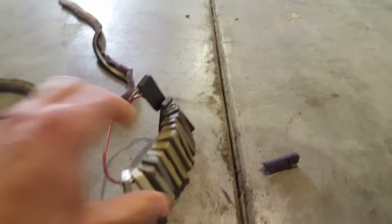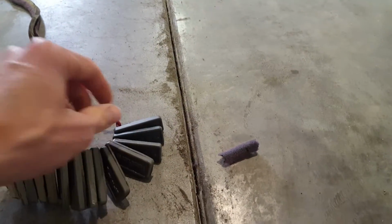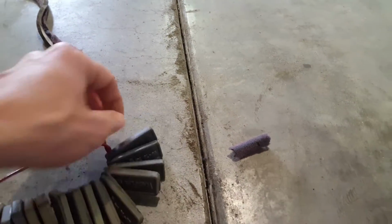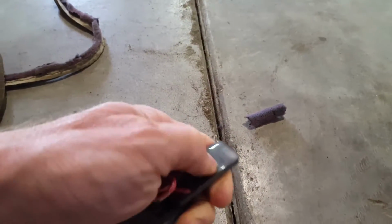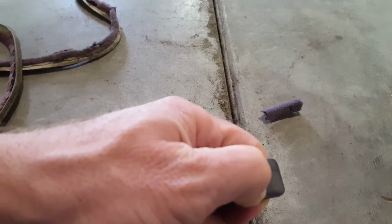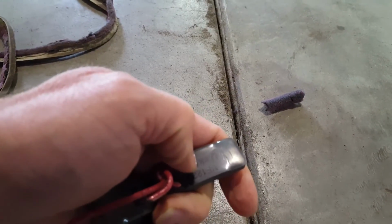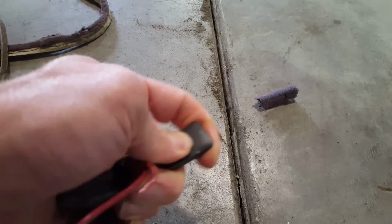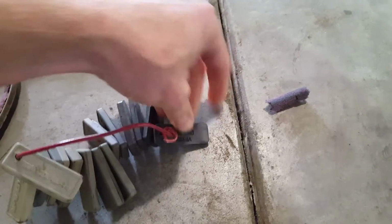So what we do is install, these are different colors actually, a polyurea 2-component product that's fairly rigid. You notice how I squeezed on the other stuff. Now look, I'm trying to put my fingernail in it, and you can see it kind of makes a slight impression and kind of bounces back. I mean, I'm squeezing hard. It's a really rigid material, so it can take forklift traffic.